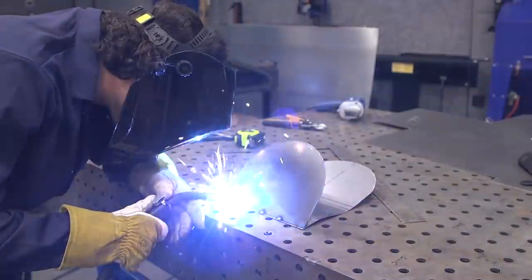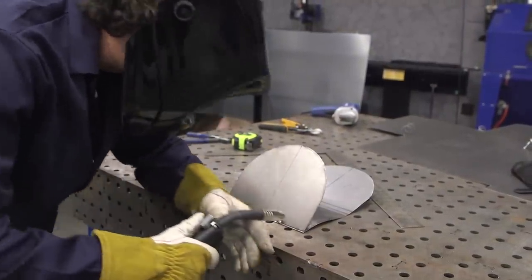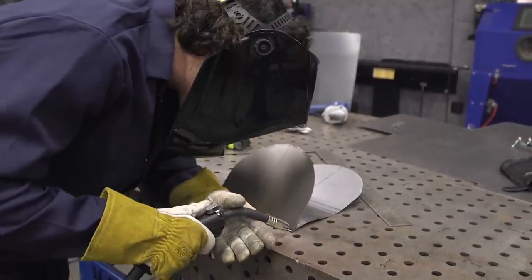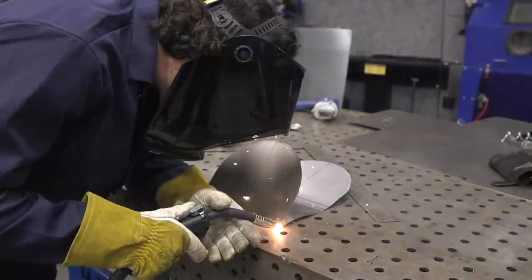At the front of the cowl, I left a little bit of lip there for my weld to lay on. It's a little better for me to grind that down later rather than have these meet at a perfect corner and have the weld eat away at that corner. If you're good with a TIG welder you can do that perfect corner, but with a MIG welder, this works too.